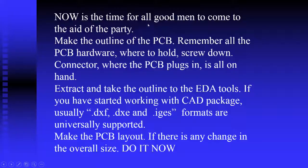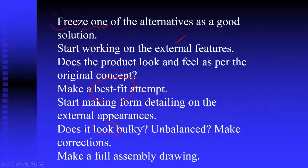Make a full assembly drawing. An assembly drawing talks about putting all the parts together. Now I am using the word 'drawing' rather than 'sketch' — a drawing is done perfectly to scale. If there is a transformer which measures 70 mm on one side and 60 mm on another, and the stack is only 30 mm with the bobbin and so on, all these details need to be represented.